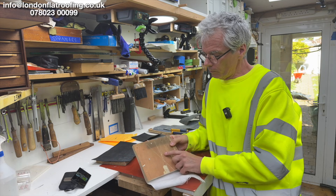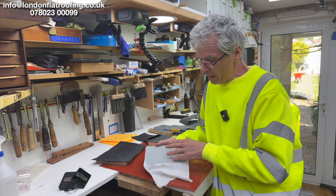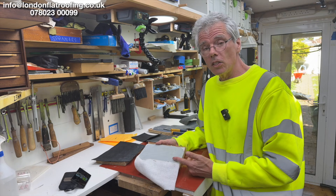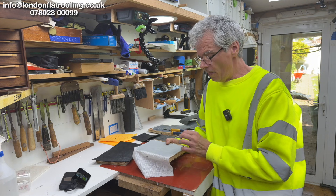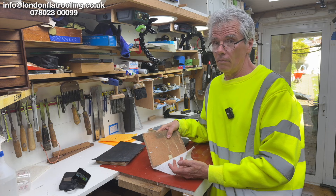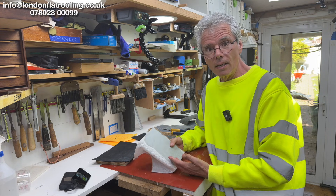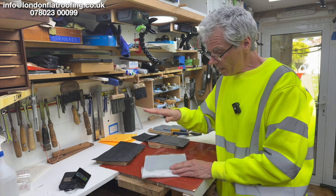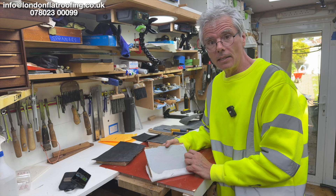When this was put together it was absolutely tight. We did our wet-on-wet and embedded this over the top — absolutely great job, finished. And we're over a crack. Now if that crack decides to move, it doesn't matter how flexible this top section is — it's only the free part that can expand. That joint was literally nothing — call it 0.1 of a millimeter. A hundred percent expansion is only another 0.1 of a millimeter, which this could probably take. But if it moves a millimeter in width, this can't take it — it's going to rip right down the center. That's because it's completely stuck on both sides and the only free piece that can move is the centerpiece, which isn't stuck to anything.